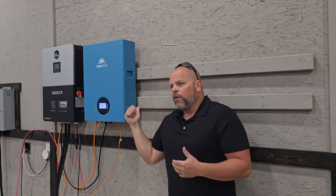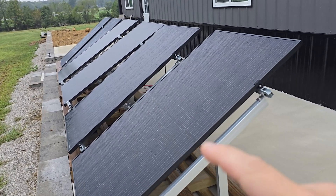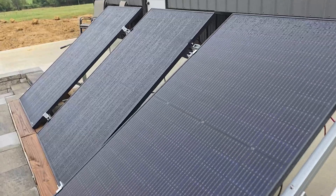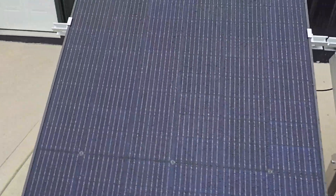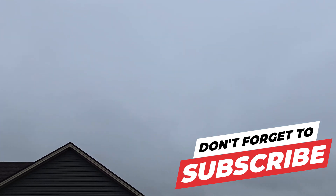What I'm really running into is if I have three days of cloudy weather, I'm not going to have enough solar generation to power the shop and charge the batteries back up to 100%. Another avenue I might have to look at is expanding this solar array. Right now I've got six 370-watt Aptos solar bifacial panels, but I just don't know if that's enough to actually charge up 10 kilowatt hours of capacity, especially on days like today when there's absolutely no sight of the sun.